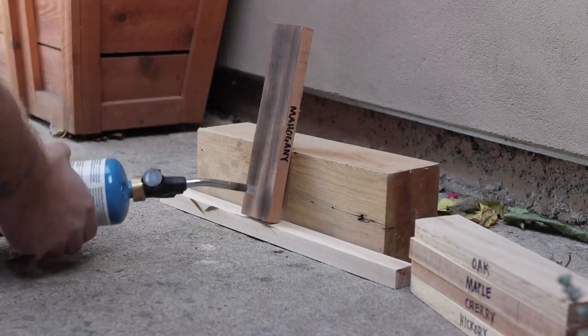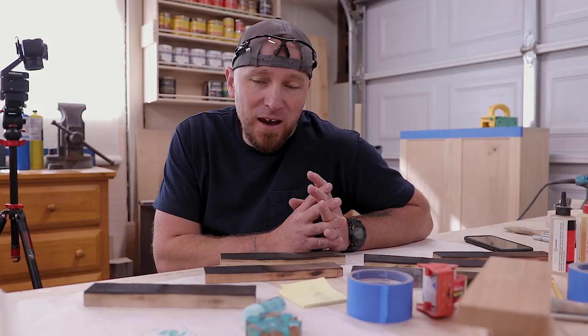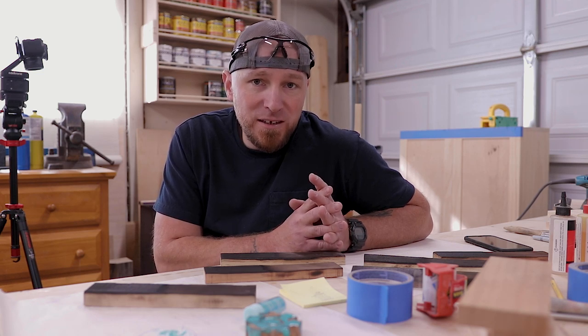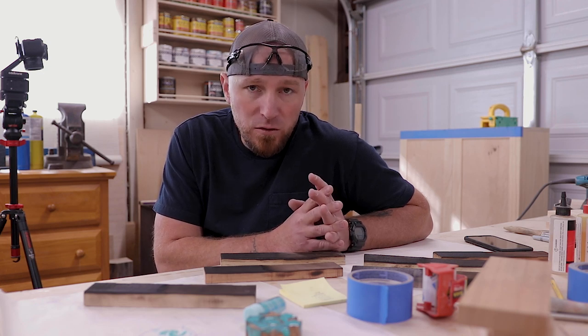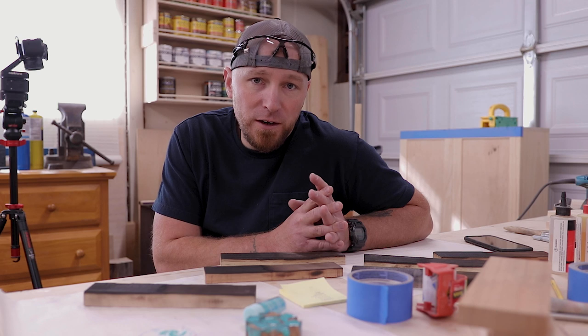Now, to burn them, I'm going to use the small propane torch, and I opted for the small torch versus the big torch because I have a feeling that's the most commonly used and available tool for you guys to burn this stuff with. Now, as we found out in the 2.0 video, there is a difference, at least with softwoods like pine and cedar, between the big torch and the high heat versus the small torch and the low heat. If you want to know more about that test we did, I will leave a link for the 2.0 video at the end of this video and in the description.